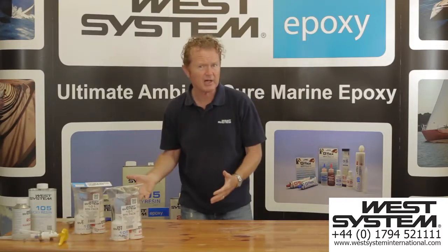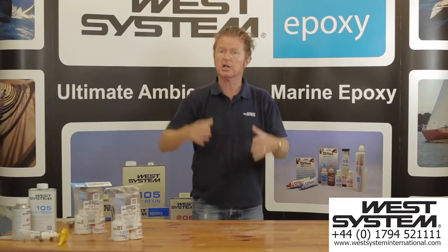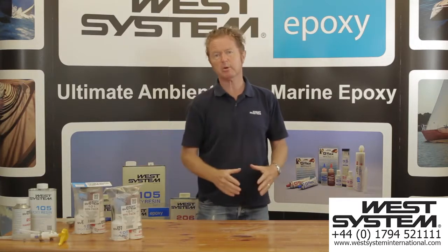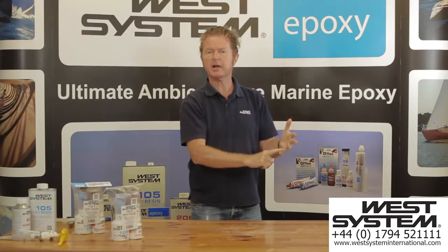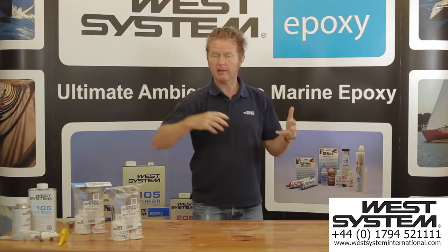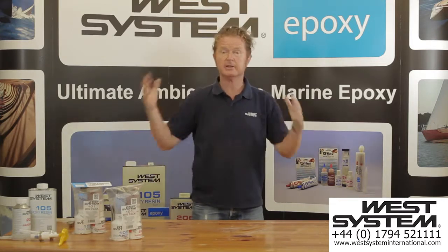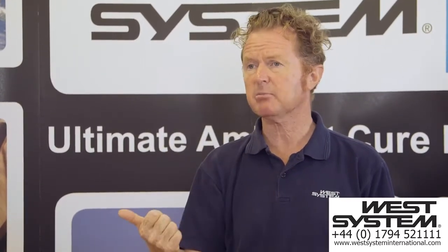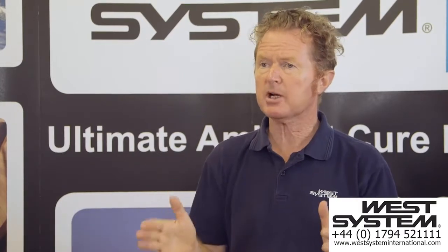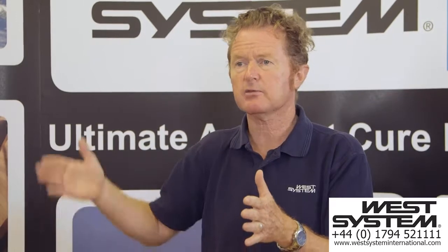If you're working outside, you can tent an area off and bring in some localised dry heat. Very important that you use a dry source of heat, so not propane nor diesel heating. Both of those methods create a lot of excess moisture in the environment, and they will really compromise your work. They'll create lots of amine blush, and they will compromise the bond between layers of subsequent coats of West System epoxy.